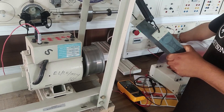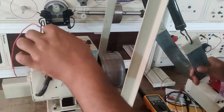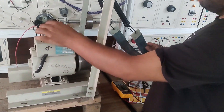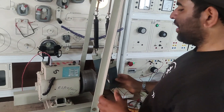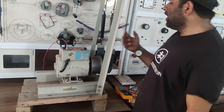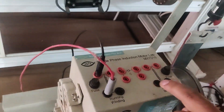I will reduce the voltage. But in industry, in normal operation, you will not always choose this way to start the single phase induction motor by manually pushing it. For that, we have different techniques to start this single phase induction motor. One of the techniques among these is the capacitor-start, capacitor-run induction motor which I have discussed with you.